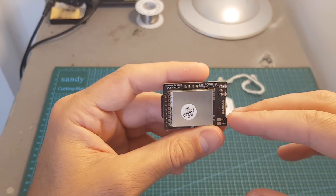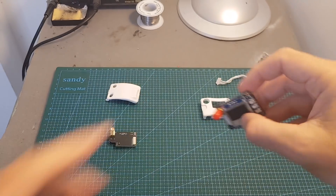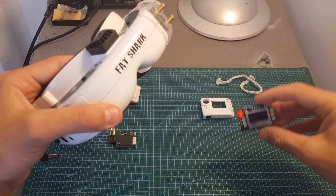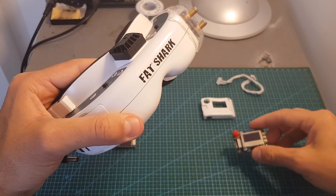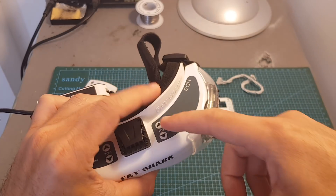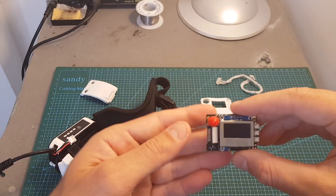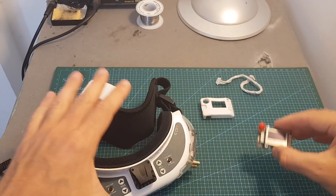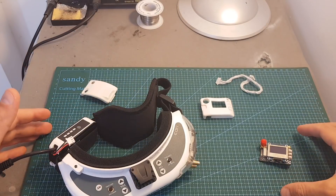On the bottom we can find two pads — the LED and ground pads — and if you want, you can use an external LED module and place it on the front of your FatShark goggles and change its colors in the receiver settings, making your goggles more interesting. This model also uses the FatShark built-in channel buttons to change channels. The highlight of this receiver is that everything shown on screen is also overlaid on the video and visible through your FatShark goggles.